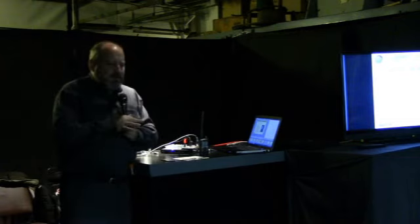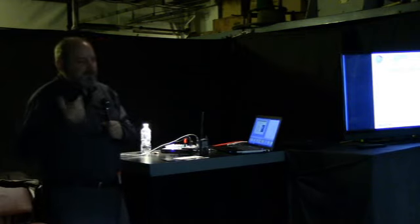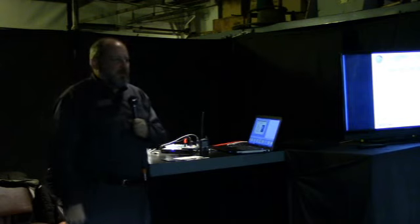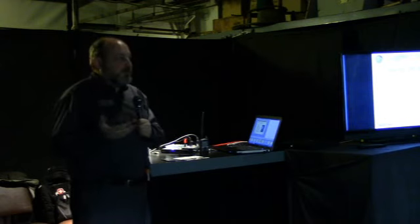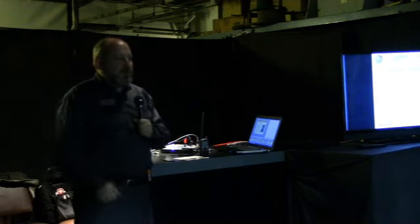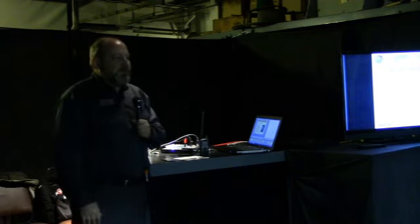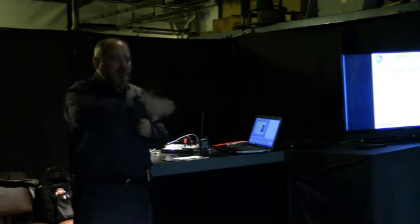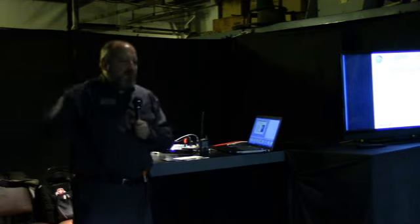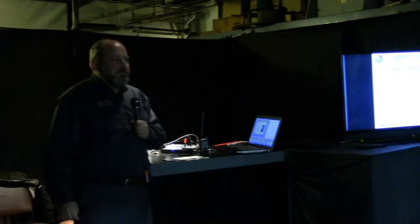The other cool thing is, one of the problems, I don't know how well you guys are organized, but I know one of the problems we have is if I wanted to talk to one of our city EOCs, some random city EOC, I really don't have any way to know what frequency they're on. I don't know where they're monitoring. In the case of DSTAR, I don't really have to. All I have to know is their call sign, right? I can do a call sign route to them. I can key the mic and call them. And the system, as long as they've checked into some node that's still on the air, I mean, the odds of you having an internet disruption that spans multiple states are pretty unlikely, right? In fact, it doesn't really happen.